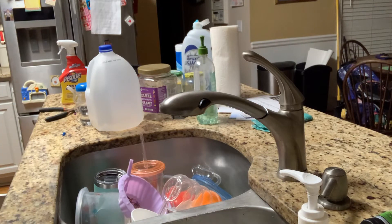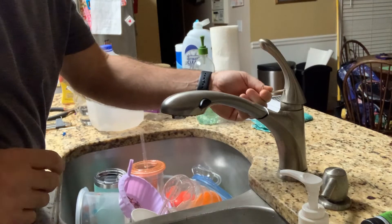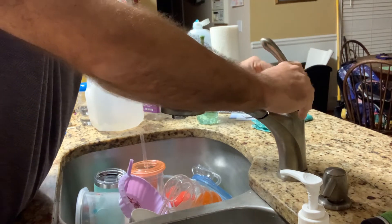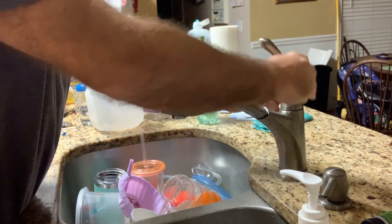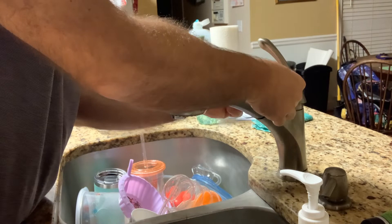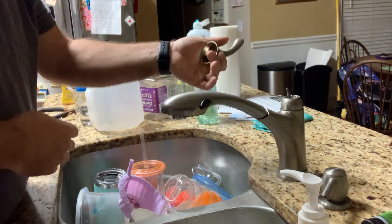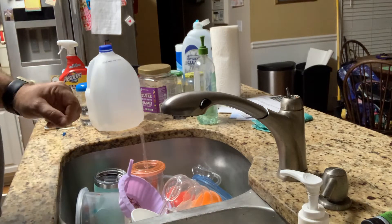You are going to need an Allen wrench for this next part — we're going to use it to separate the handle. I've got my Allen wrench in here and I'm going to go ahead and turn to the left. I might have to use as much torque as I can get there. I did a couple of turns and was able to get it to pop right off. So I've got the faucet head off, and we're now looking directly into the current cartridge.